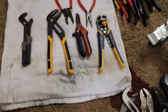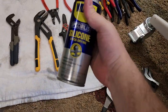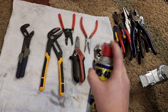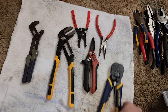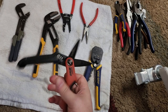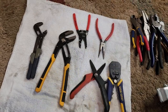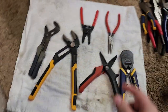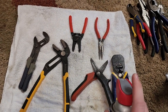I'll show you exactly what I mean. I have a junk towel here and I lubricate the tools using silicone — I find it works really well without depleting the handles. I give them kind of a heavy bath, but that's because they're on the towel. I flip them around and wiggle them on the towel, which cleans off extra oil and rubs it into the pores. Notice how all my pliers are opened up — that's important because you want to get all the mating surfaces where rust usually begins. Definitely get near the joints of your pliers and the blades of scissors.